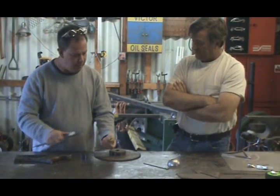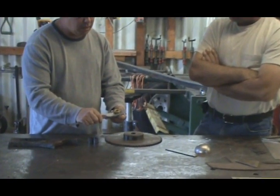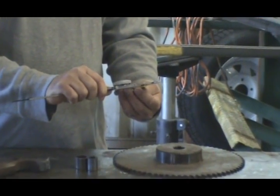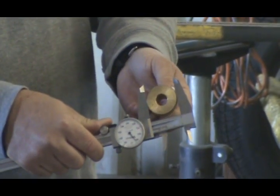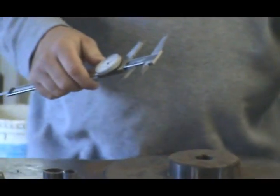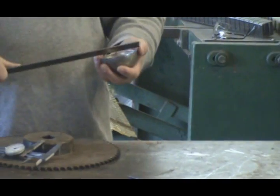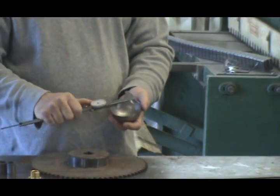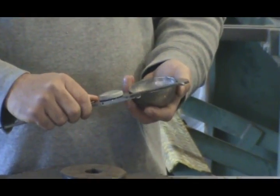Even for anything around the shop, you can use this side of the caliper to check what size something is, and it's kind of fun just to play with. This particular size is one and seven sixteenths. Now you have a sphere here — how do you measure a sphere? A lot of people will just take a simple scale and say it's three inches. But just to illustrate the purpose of the caliper, we can do the same thing — spread it down here: three inches. Exactly.